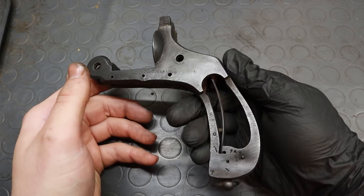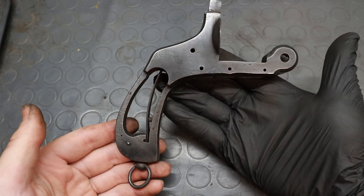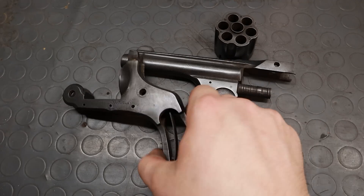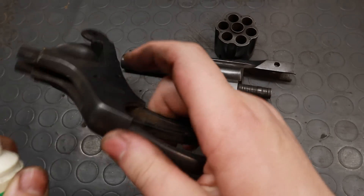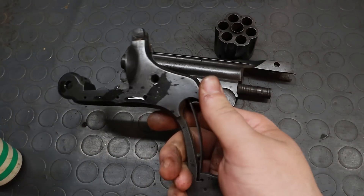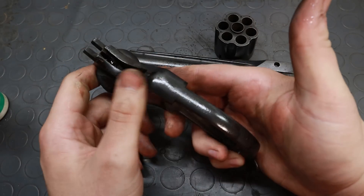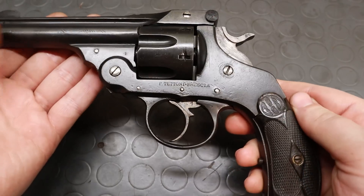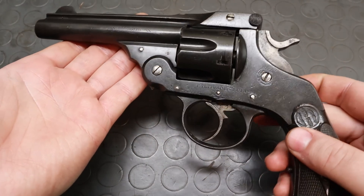Once you're satisfied, you can go to oiling. Keep in mind that without oil, a blued surface is only marginally more resistant to corrosion than the same unblued steel. However, bluing helps retain oil much better than naked steel, and that can indeed improve corrosion resistance as long as the surface is kept oiled. Practically any oil will do the trick — there are stories about certain oils damaging newly formed bluing, but I've honestly never seen this happen in person. Any gun oil I've tried works fine, but do your own testing just in case.